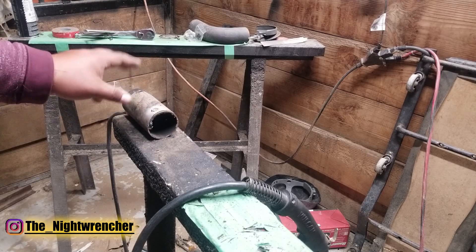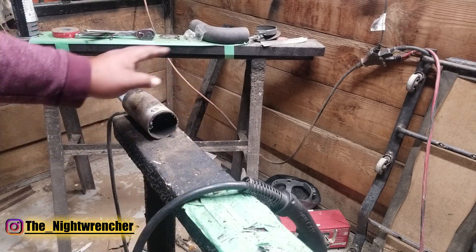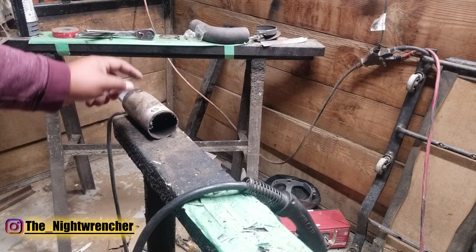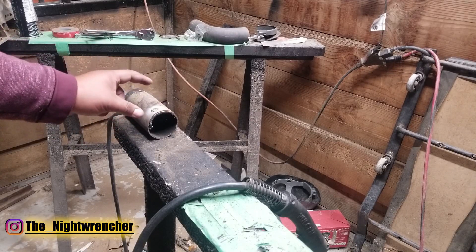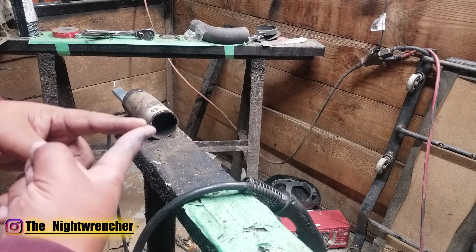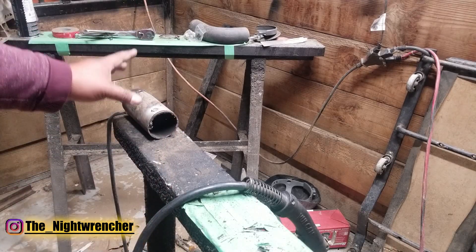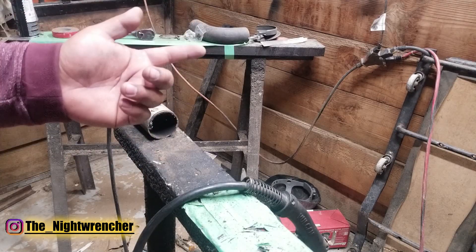When you guys have dirty material or a dirty ground, what's going to happen is that you're going to cut the electrical current going from your ground or from your electrode, and you're breaking up the circuit, the connection in between them. So maybe while you're spot welding it's doing well, but as soon as you try to run a bead all the way across, all the contaminants in the material are going to get trapped and interrupt your circuit — causing excessive spatter, making your bead look wonky, and making you think your settings are incorrect when in reality it's just your material that needs to be cleaned. The cleaner you can get your material, the nicer your welds are going to come out.